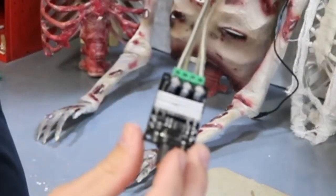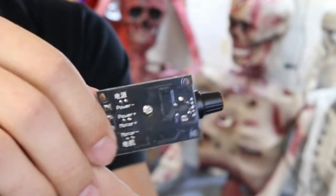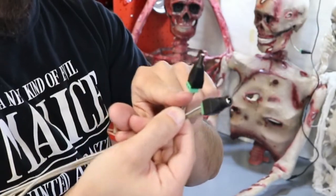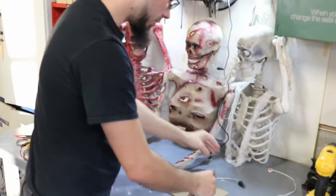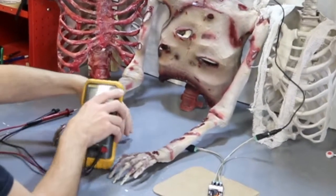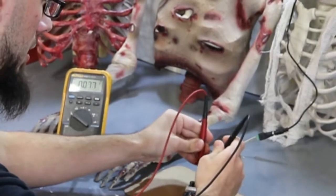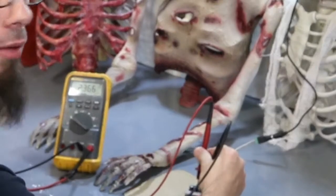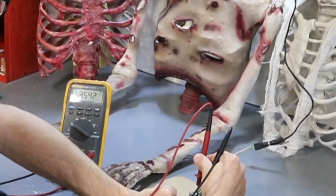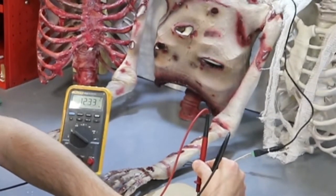So let me show you our potentiometer. On the back it does show you where your power comes in and goes out to the motor. I put these little pigtails on here with CCTV terminals — they've got little terminal screws, so it's really good for mocking stuff up. Nothing permanent, you can pull it out real quick. 12 volt, two amp power supply, voltmeter on — I've got 12 volts going in and I'm going to put my leads on the out terminals. All the way counterclockwise, which would be almost 12 o'clock — that should be about off — we're getting 2.3 volts. We go to about three o'clock, we're getting 3.5. Six o'clock is about seven. And if we go all the way around, almost back to 12, we're at 12 volts.